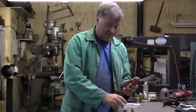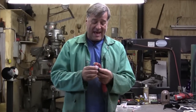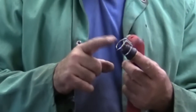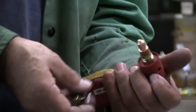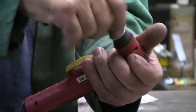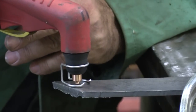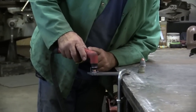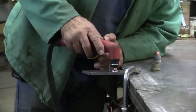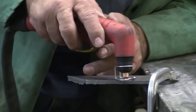But if you shake a little, or if you're just going to make a long cut or something, they have a drag guide. And this just goes on in place of your regular cap, screws right into place. Now you've got this little guide that allows you to keep your distance off your metal. It prevents you from grounding out the tip, shorting the gun out to the metal. And you can see what you're doing — you just drag that little guide along the metal with you.